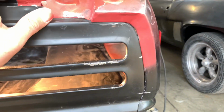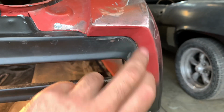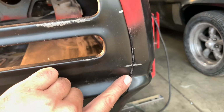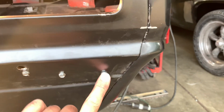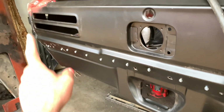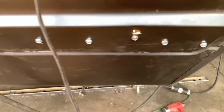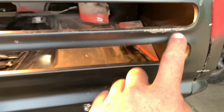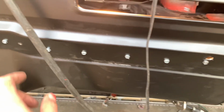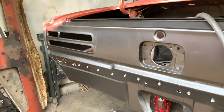Now, I said it's pulled up really tight and pretty clean. Got a little filler work here, like I said, when I welded that thing in, but I'm not going to get much better than that. This is looking real good. Now we'll come through here and pretty self-explanatory. I'll burn all those in pretty quick. Do the same thing to the other side, and we'll drop our spot welds in through here, and then across the bottom. So really, that's probably the worst part about it, is just getting in there and doing that. But I'd say the rest of this, you've seen this all before, so I don't think that's necessarily new, but I'll get it all welded in just the same.